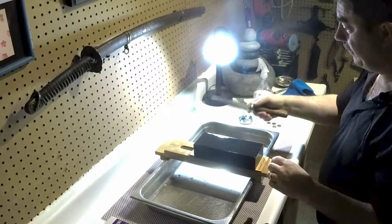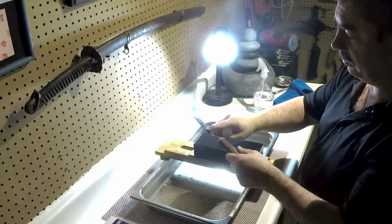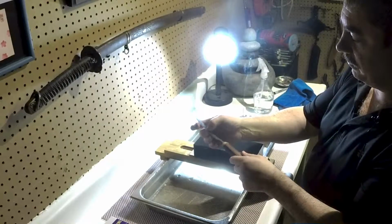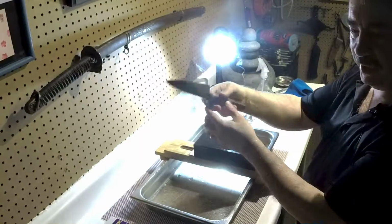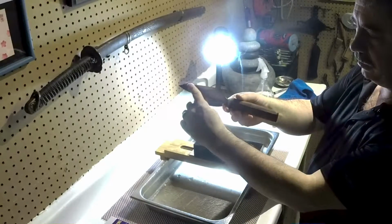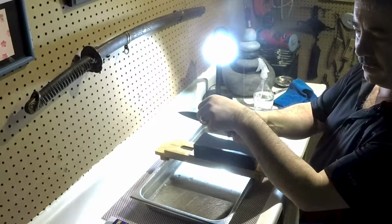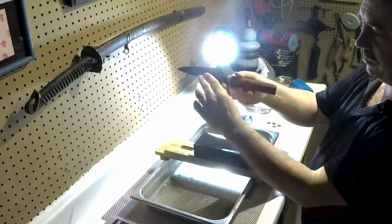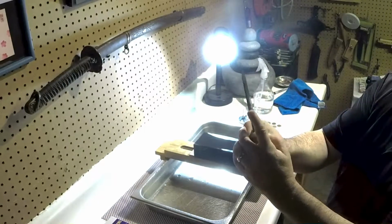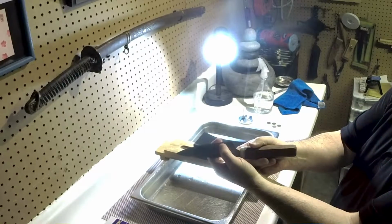Now, later on when you're using a knife after a year or whatever, you're removing steel. A lot of people think it's just the edge, but as you're folding it and putting a burr on either side of your blade, and that gives you your sharp edge, once you take that burr off, that's a piece of steel gone, right? So this triangled piece of knife, this edge, is slowly going to come up. Where the blade was thin, it's going to get thicker and thicker.